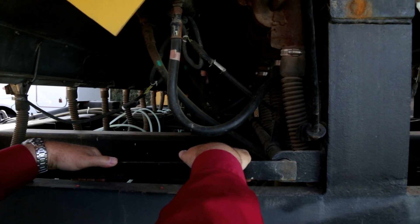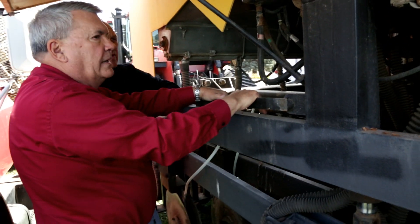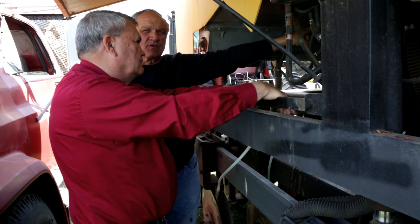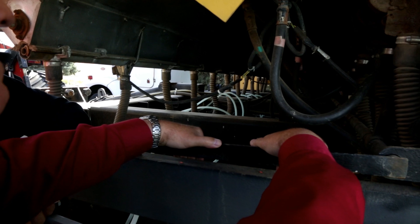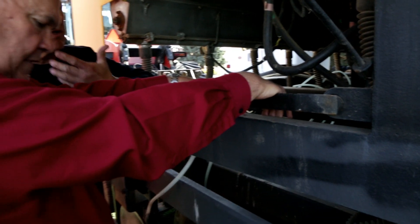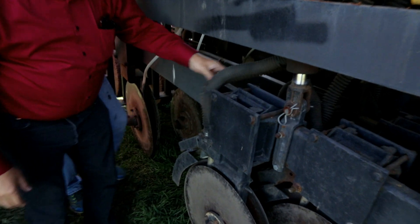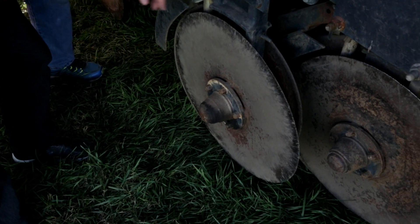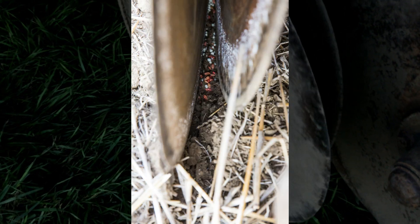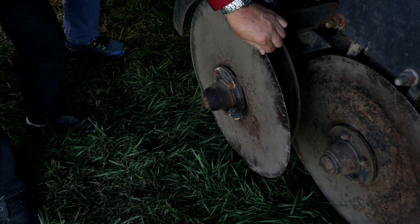With fluted feeds and the tractor, the driver was remote to the drill and couldn't see the seed metering, but you can look in these cups and see what was going on. The way we monitor the seed rate on this is with sprocketing gear ratios — it's a Barber engineered gear system. If you want more seed you raise your ratio; if you want less seed you lower it by the gear reduction. The seed comes down this tube here, and the dry phosphate goes in first — that's really important — and then the seed goes down through this tube and comes out right here, trapped in that convergence.